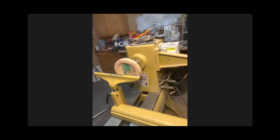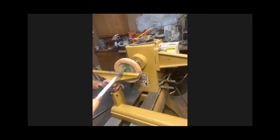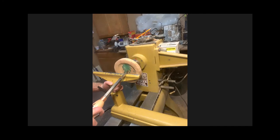Oops. Now I want you to use a bowl gouge in reverse. Can we do that on the next demo when I get him paid quadruple? Got your Kevlar on for that one, don't you? I've done it. It works great, especially if you've got problematic grain. If you put it in reverse and turn on the other side, nine times out of ten, it'll come off like normal.